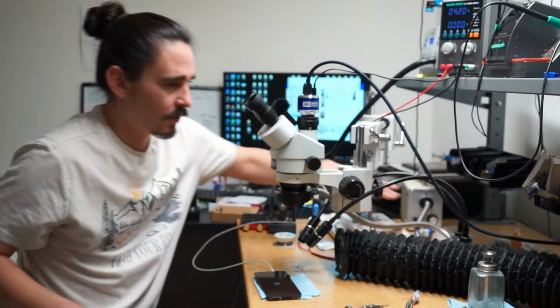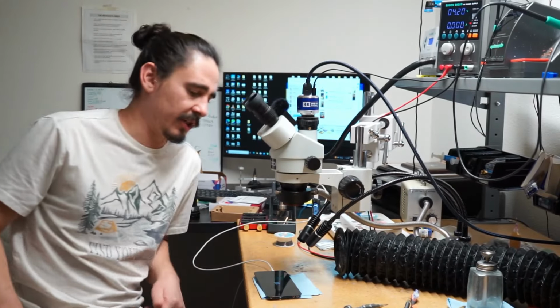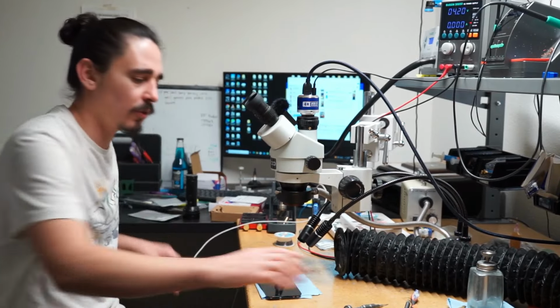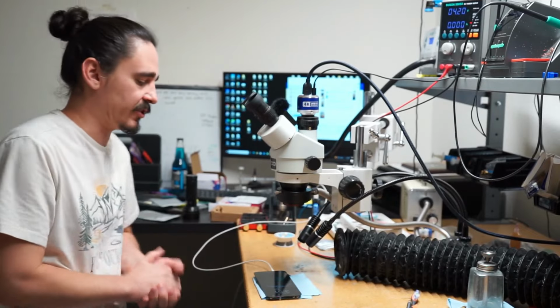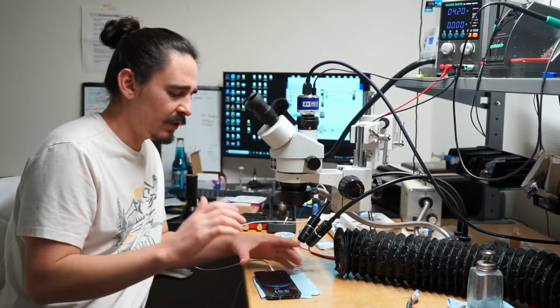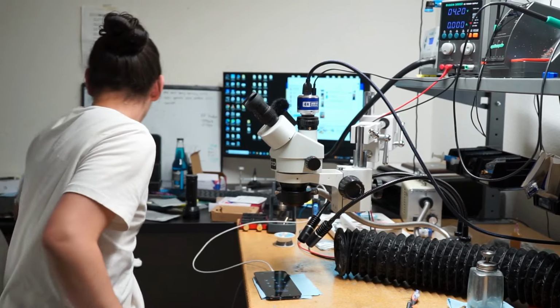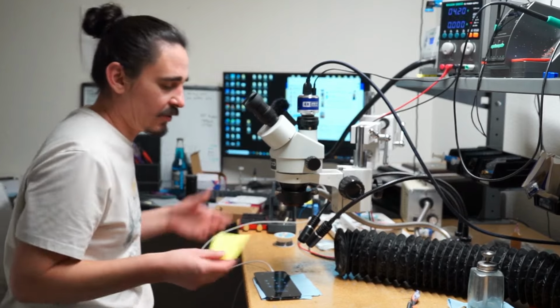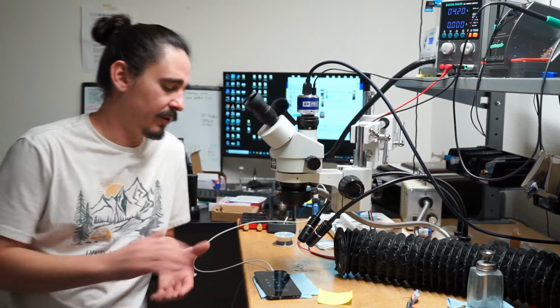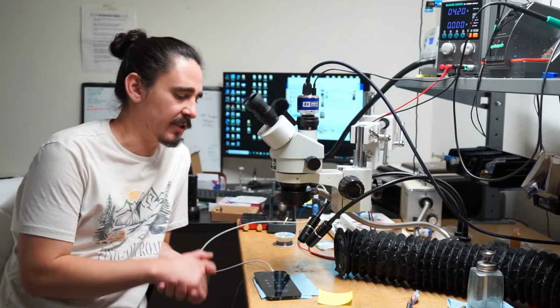No way. It booted. So that's definitely something I probably should have checked first. Like I said, it's not part of my normal routine because I've just never really seen this go bad. But the crystal oscillator is needed for the PMIC to turn on. And, you know, I didn't really know the PMU requirements to turn on.